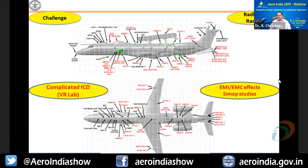The challenge here is, what do we do when we have too many antennas and too many sensors all around the aircraft? How do we avoid the mutual coupling or interference from one to the other? It is possible only if we have 3 things: space, frequency, and time. When I say space, that means if I want one antenna not to interfere with another antenna, obviously we have to separate them as far as possible. With the given small aircraft, there is a limitation on that. You cannot indefinitely keep them separate. So there is a limitation.